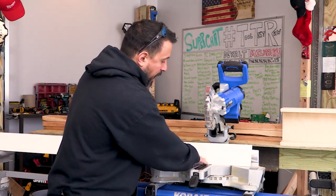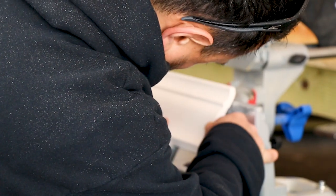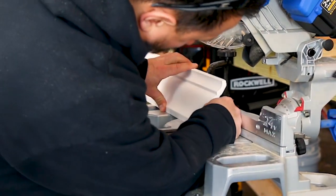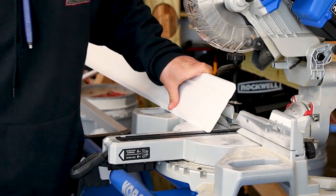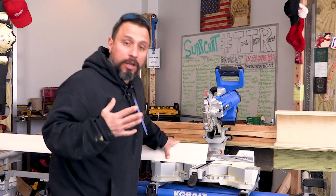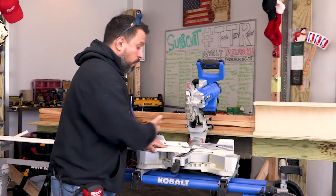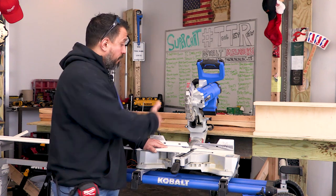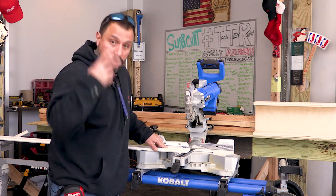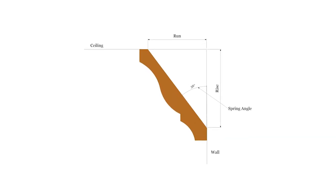When your saw runs out of capacity, you can see here on edge that nested against the fence we're riding above the fence — there's no good way to make this happen rapidly and accurately enough to where I would trust it. Anything beyond three and five eighths, you're gonna need a simple trick. Here it is: the simple trick is to cut your crown molding flat. You have the ability, even with a seven and a quarter inch compound sliding miter saw — you think this saw is small, but the capacity is very large because of the features built in.